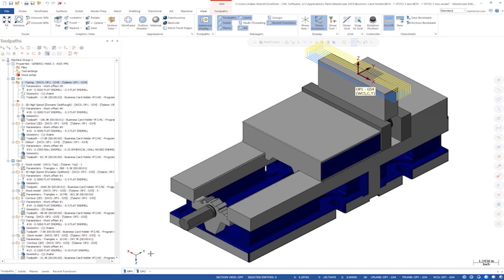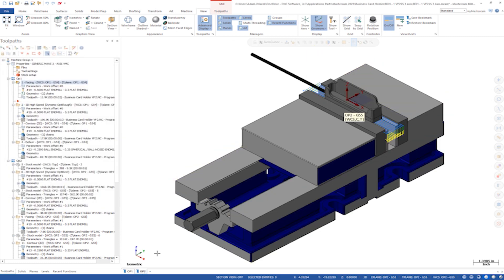It's a similar scenario for OP2. On the second view sheet, notice that the plane for OP2 now comes from the bottom of the part, or the top of the parallels, and I'm gripping the part on the flat finished faces. I also have a stock model setup that tracks the stock from OP1. Because the part is in the same location, tracking the stock is super simple and certainly makes OP2 rest roughing toolpaths more efficient.